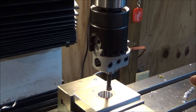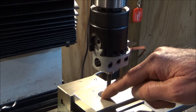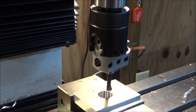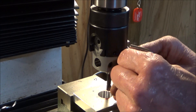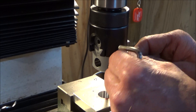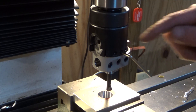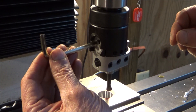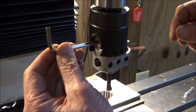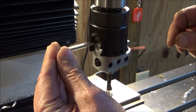The spindle was already in line with the hole and I've already brought the boring head down and touched the cutter off on the inside of the bore. So now all I have to do is advance the cutter — I just loosen the center gib screw. This center one has a ball bearing that will lock the gib. I'm going to advance it; there's a little scale over here and I'm going to advance it 20 thousandths and see how that works.